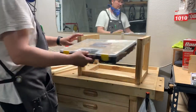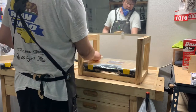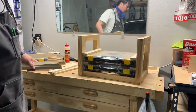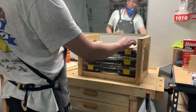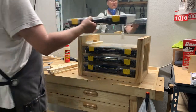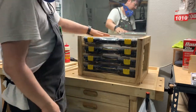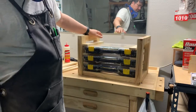For the side slats to hold the storage bins, I took some pallet slats, ripped them in half, and then attached them along the side frame to serve as shelves for the storage bins. Here you can see I've ripped my pallet slats to the appropriate size and I'm figuring out where along the side frame they need to be placed.